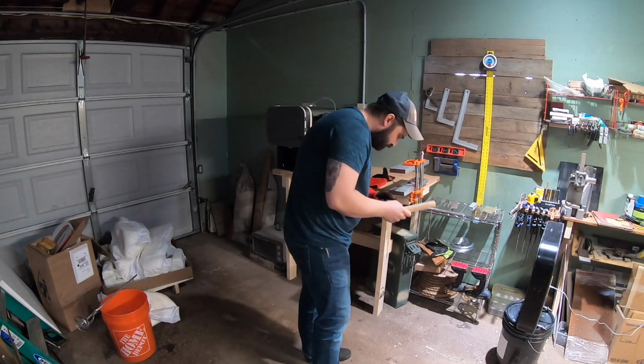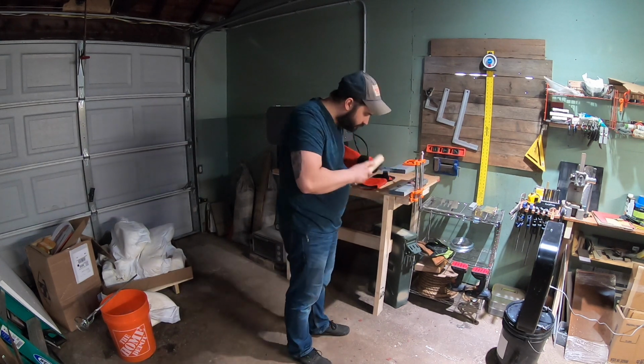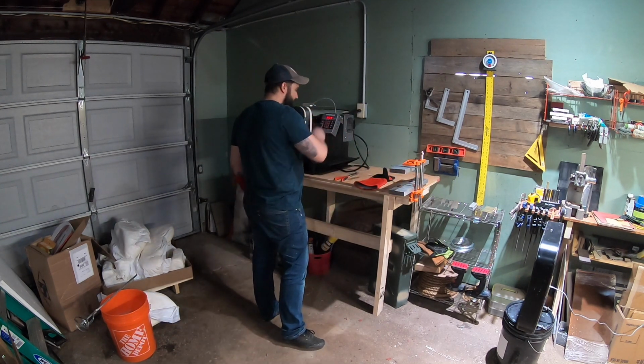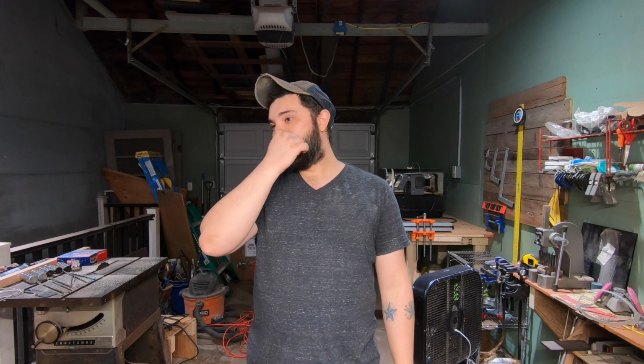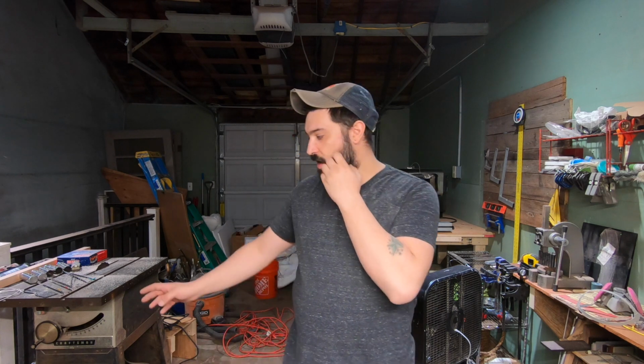When I took it all out of that Ceram guard, I used a wire brush and got it all off, got it down to probably 150 degrees. I held it in a glove and ran it downstairs, did a quick HRC test, and it's super soft, obviously because of all that decarb. So I cryoed both knives and then tempered. After the first temper, I did 925 for 1 hour. The reason I didn't do 2 hours was because I just wanted to get that temper set after getting rid of the retained austenite through the cryo.